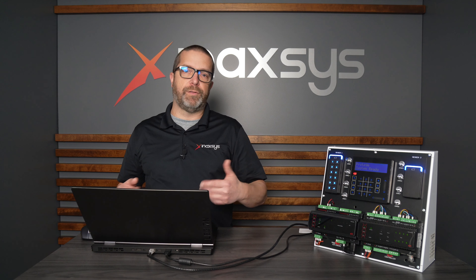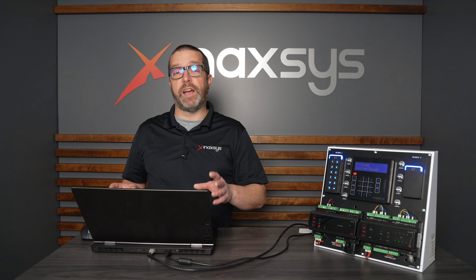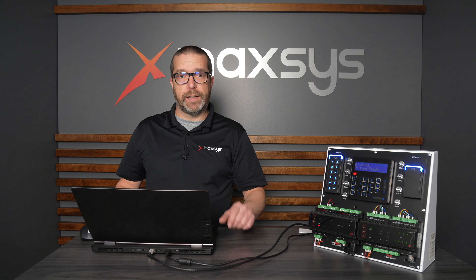Updating the firmware is very easy. The reason I'm making this video is to make sure that you understand what to look for after upgrading the firmware — like rearming partitions or restarting services. Sometimes upgrading the firmware will not change the internal database of the controller, but sometimes it will change the database, so there's a possibility you may have to do some module updates after the firmware. I want to make sure you don't leave a site before ensuring everything is working normally and every partition is secured. It takes about five minutes to push the firmware to the controller.